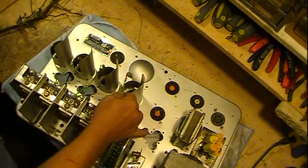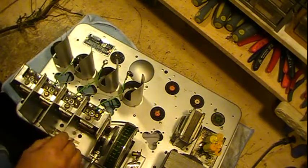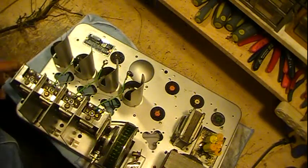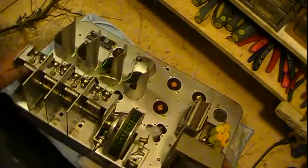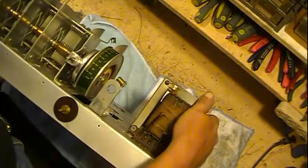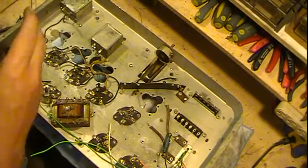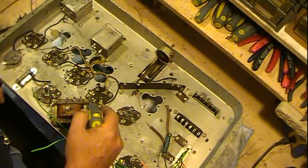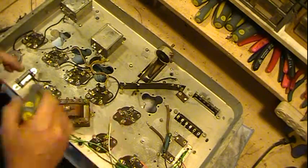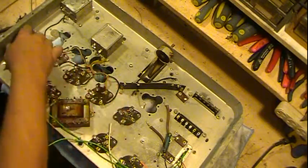And we replaced the wires on the grid caps because they were rubber and rotted away. And basically we painted the chassis, and like I said, I tried getting as close to a match as I possibly could. Now on those tube shields, like I was saying, they come up through here and are just nutted on. So when you take those off to clean them up, then the sockets are completely loose.